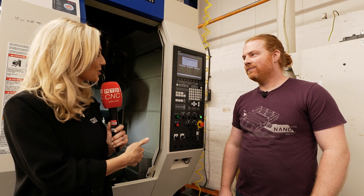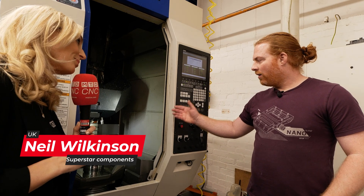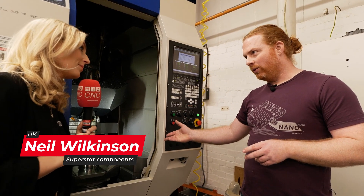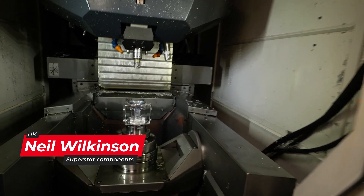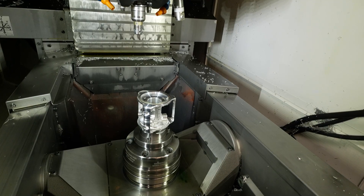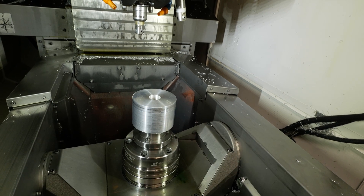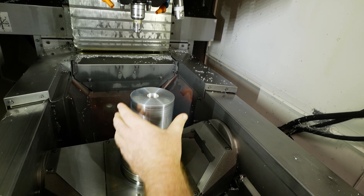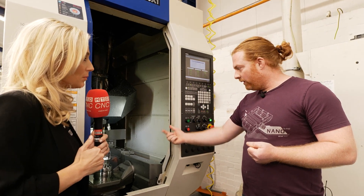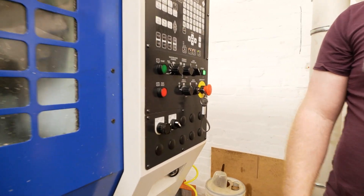Neil, you've got quite an interesting story here — this is a sign of true engineering. We have been making hubs for years for mountain bikes, but one of our customers came to us and wanted a very complicated monoblock hub for a wheelchair wheel. It's got carbon fibre leaf springs which are epoxy bonded — hence the rough surface on the inside — and you would think it's a lathe part, but actually it's pretty much a milled part. So we invested in a Brother Speedio MX140 for a mill-turn solution.